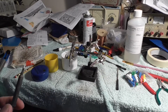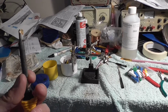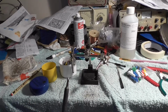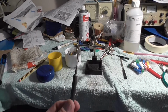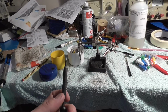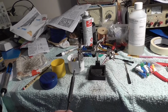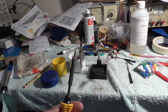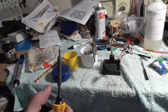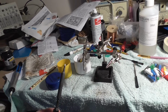One more thing, in case you guys are wondering, those of you that just joined my channel, why am I using separate soldering irons and messing on with changing separate bits? Why not have a solder station where you can change a thermostat to increase the temperature as and when you need? Well, the reason I like to use a separate soldering iron is because if something goes wrong, you've always got a soldering iron to fall back on, whereas if your solder station goes wrong, you're pretty well had it. So I like to have plenty of soldering irons around. I will be buying some more as time goes on, as I recover from all the things I bought, because these elements do go. It's cheaper just to buy another iron really, and the bits are quite expensive. I've got a collection of them if I could find them.